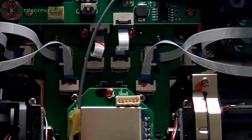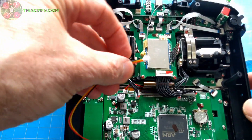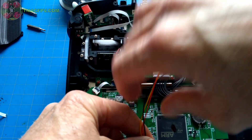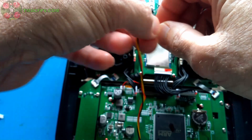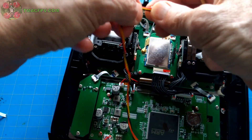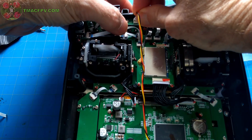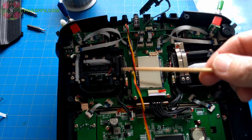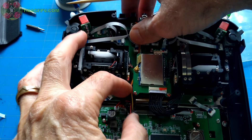Now that we've got our new board installed with the two screws reinserted, all we need to do is connect this wiring harness up to the new board through the connector. These wires are a bit loose, so I hold one end where they're soldered and twist them a little bit so they're not running around loose. With the red wire on the right-hand side, insert the connector — this connector should only go in one way, but remember: red, right. Both start with R. Make sure the antenna wire is underneath the USB-C board wire, then tuck the wiring in so it's not flopping around. We're all set.